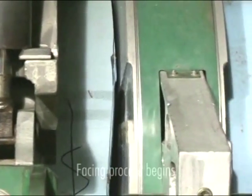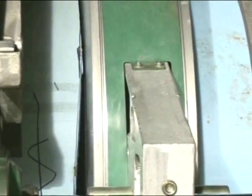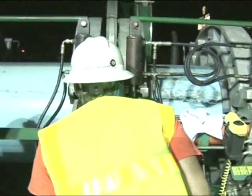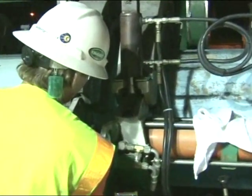The facer plate is rotated slowly to allow the facer blades to trim the pipe ends so they are parallel with each other. As the pipe is brought against the facer plate, thin pipe shavings are machined from the pipe ends, resulting in a smooth edge that will provide 100% contact with the heat plate. Facing continues until the technician reaches the designated stops on each side of the fusion machine facer plate, which hold the facer in exact alignment. As most pipe ends are cut at the extrusion facility, they are already nearly square and parallel, so very little material needs to be machined from each end.